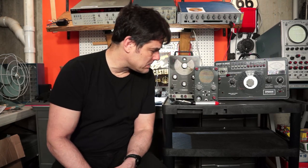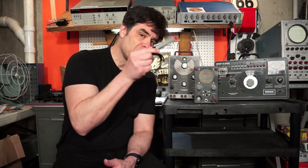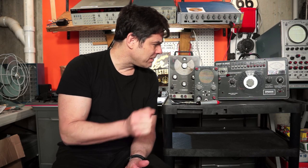I don't need the tube tester as much as I need the signal tracer. This is the one I'm going to do next, because not only can it trace a signal through the circuit — for example, when the signal is going through a path in a guitar amplifier, you can probe the circuit and hear the sound through its speaker — it also does a whole bunch of other things. It can even inject roughly 100 volts into a circuit to do additional diagnostic tests. So it gets you more quickly to the end of your repair journey with a given device.